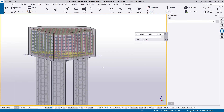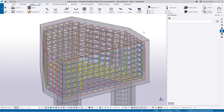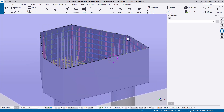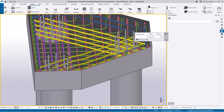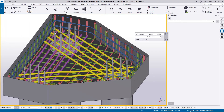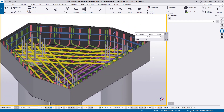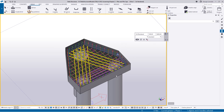I can now remove the construction lines on both sides. Looking at the whole assembly in solid view — using the Scissors tool (Ctrl+X) to cut a section — we can see the rebar sits very nicely in its different layers. You could adjust cover or leg face settings to shift bars slightly from the edge, but this is essentially complete. I hope you enjoyed this video and this first chapter in the series — see you soon in the next chapter, thank you for watching.